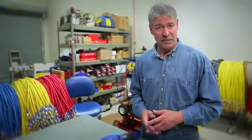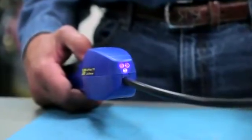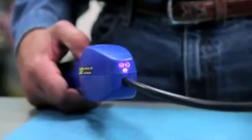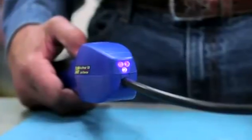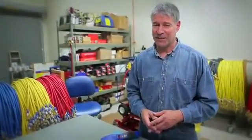The AcuProbe UV also features a three LED UV light system which works with 395 to 415 nanometer wavelength leak tracing dyes, for use on systems that were either installed with or have had dye injected in past service calls. That's it for now — until next time, thanks for watching.